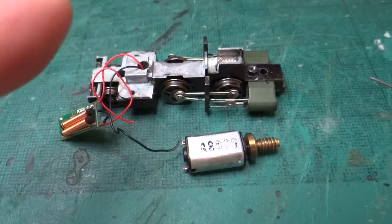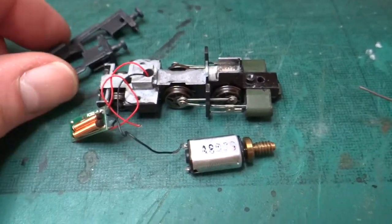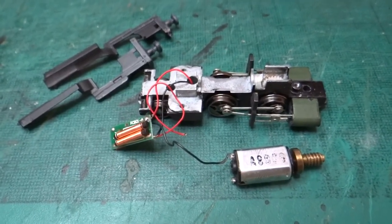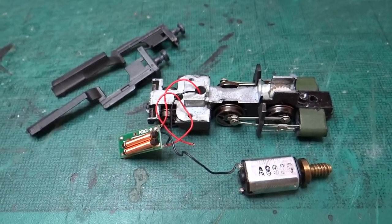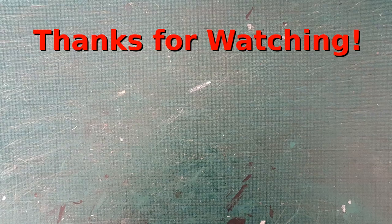I've tested the motor with just track power straight to it and it's fine. Given that this isn't stepping the voltage down, and the amount of trouble it's caused me, I think I'm just gonna cut it off and have the pickups wired direct to the motor - a lot less joints to worry about. But given the state of the pile of pieces, it's gonna take me a little longer than planned to put back together. Depending on how demoralized I get trying to resolder this, I might switch to having a look at the G series Simplex again.